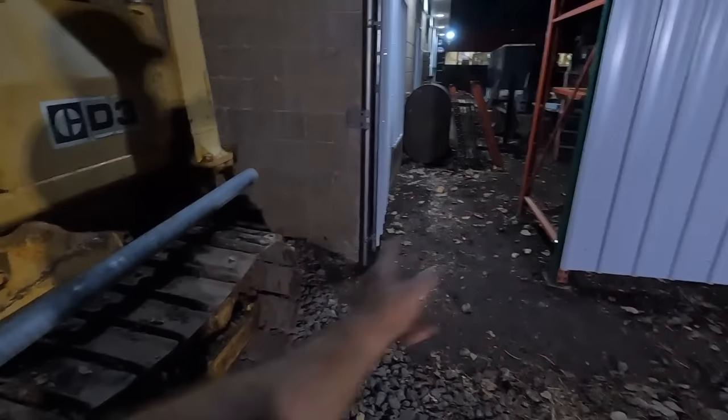Right now, what we need to know is how wide the opening is and exactly where that post is gonna go. We'll do that by laying out the gates and then the latches, which these gates have a couple of similar ones. We'll measure out how wide. There's some adjustment that you have both on the post and on the latch. And so there can be, I think it's like 5 or 6 inches of play, probably on each side, plus the opening in the middle can be as wide as 5 to 8 inches wide, depending on how that latch comes in. And the latch is gonna be a similar type to this, that basically it comes down, this is the one side of it, and it basically has two pieces of metal that go down in here and connect.